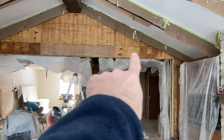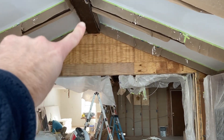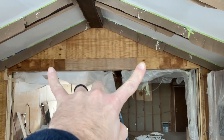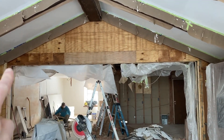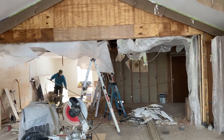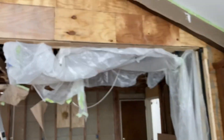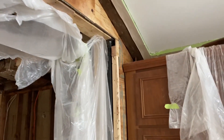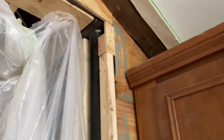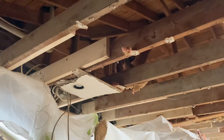So we took the weight, ran the beam all the way across, and dropped it on either side with a beam. Up in the attic there is actually an I-beam that is supported by a metal post, and that rests down on this I-beam and spreads the weight out. Initially I thought it wouldn't be a big deal, but when the structural engineer climbed up there he made the recommendation to go with this system and made sure the I-beam was weighted to carry that kind of load.